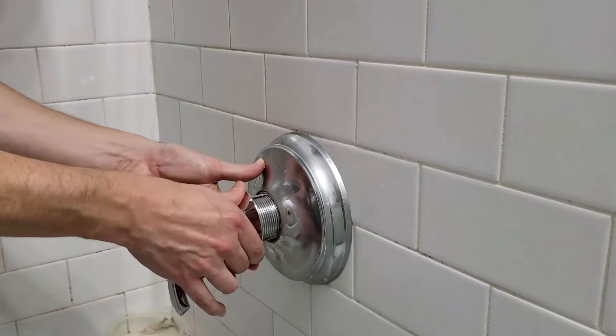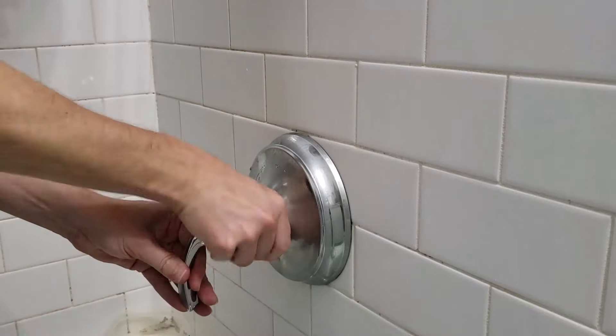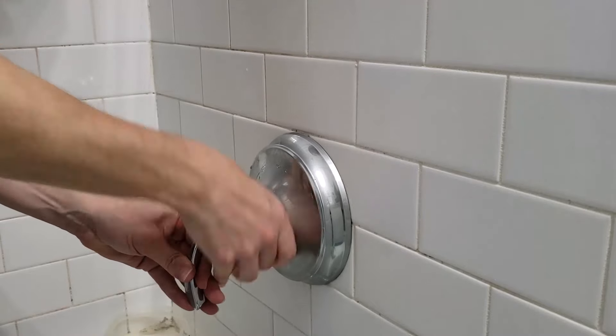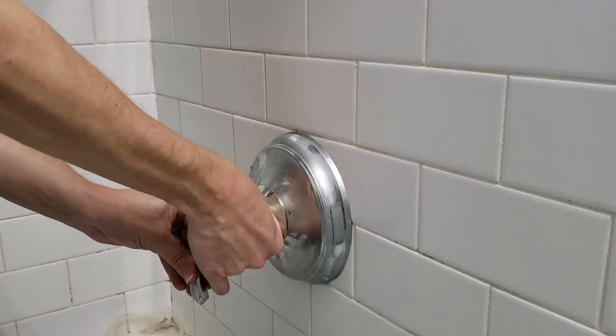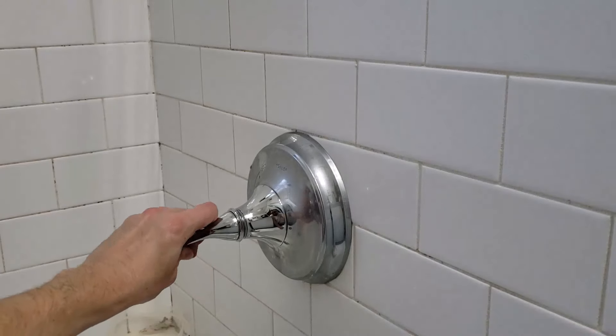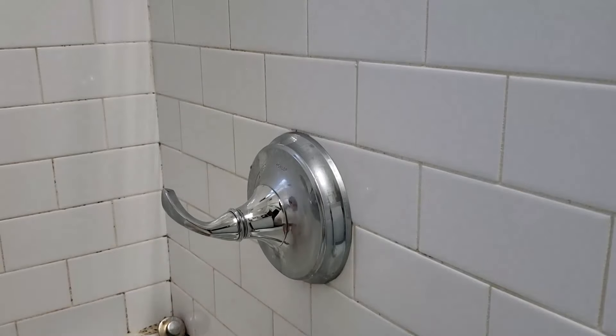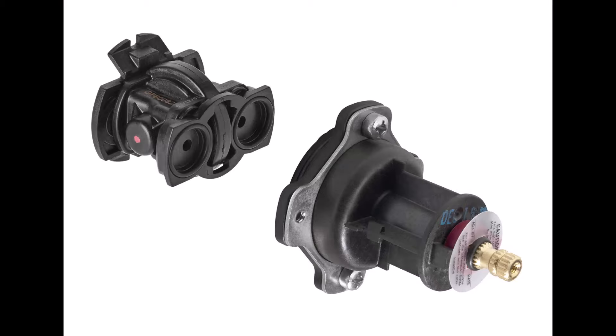Finally he'll put on the backing plate and then the handle with that threaded surround, which threads into the white plastic piece. He removed it by gripping that outer piece of the handle and unscrewing it, which loosens both the handle and the backing plate. Now with the valve in place and everything buttoned up, he's testing the valve. There are two things to test: does it go from cold to hot properly, and does it no longer leak? And that completes the Kohler cartridge replacement. If you have any questions leave them in the comments and we'll get back to you.